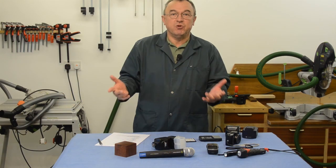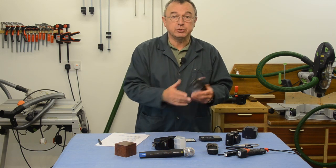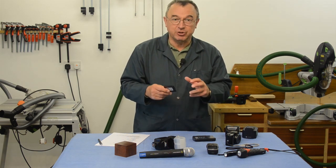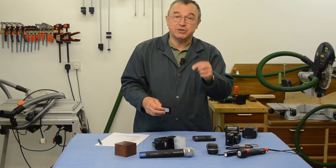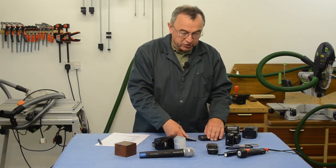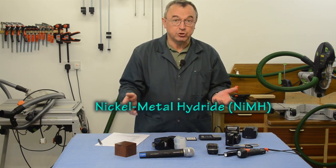If you're using power tools, get lithium-ion batteries — but the problem with lithium-ion is that the voltages are wrong to package them into a AA, AAA, C, or D type cell, because you want one and a half volts there, but lithium-ion is giving you 3.7 or more. So the technology we use is nickel metal hydride, which has been around for a number of years now. It's well proven and it's a good technology.